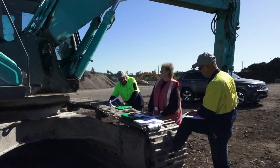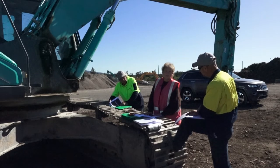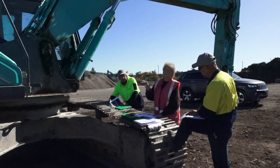The cylinders are 5 millimetres internal steel. The gas companies stipulate in their regulations that those cylinders can take an impact of a handgun. So they're not like an LPG system where it's made of a soft aluminium alloy. These cylinders are made to take impact.